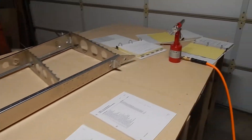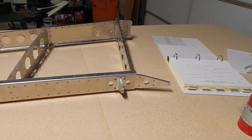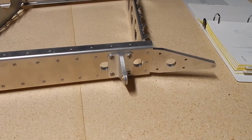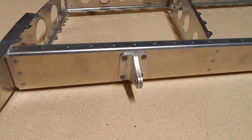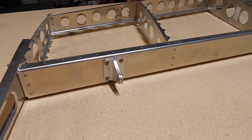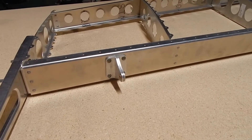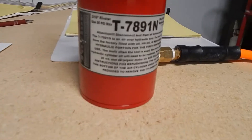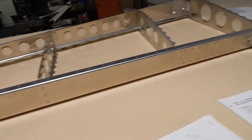I'm using the air compressor rivet gun sent by Rans. It did fine on all the 1/8-inch rivets, which there are a ton of. But the stainless steel rivets that are larger, used for the rudder hinges — there are eight of them — were hard to pull. At 50 pounds of pressure the gun didn't pull them. At 90 pounds it pulled the rivet but left the mandrel in place. After some research, someone recommended going above 90. My gun was rated at 90 pounds, so I moved it up to 100 pounds and sure enough it pulled.